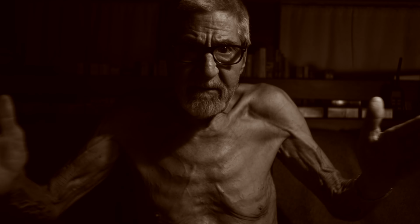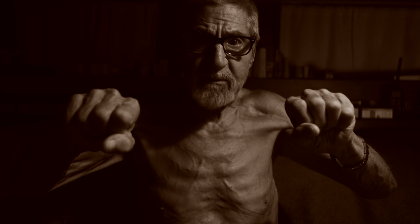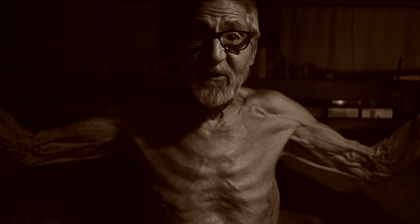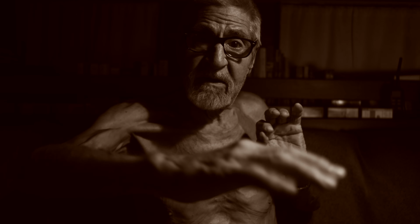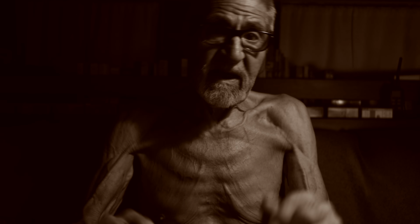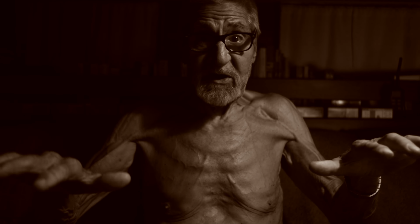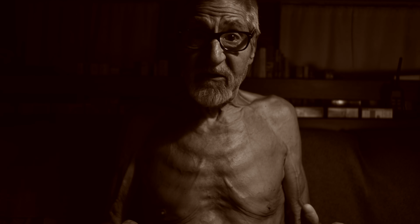You glue this and put it into each side, put it together, clamp it across with huge pipe clamps up to 16 feet. The beauty of pipe clamps, you just screw them together, you can go forever for length. And also clamp them with the cambered 2x4s. And so now you have the assembled plywood for a particular bulkhead. And here you apply the only part of the drawings that is full size.